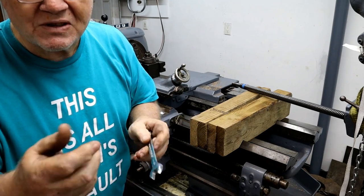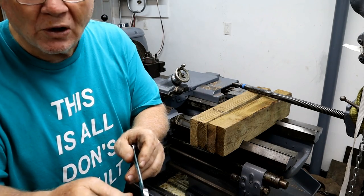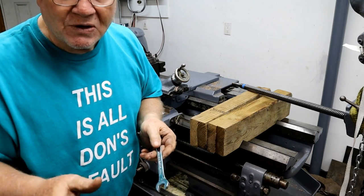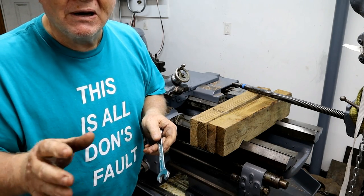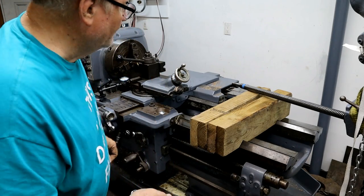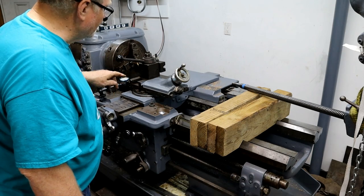Now, that's a 1/2-inch carbide bar. It springs a lot. So all I've been doing for the last 7 passes is leaving it set on the same setting and just taking a spring pass. And I am cutting material. Now I'm going to go and do the other side of the thread.